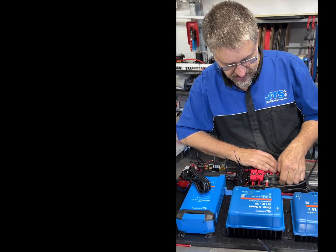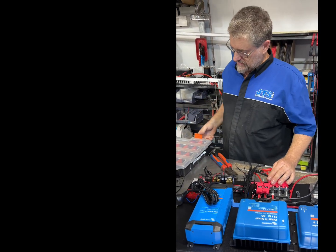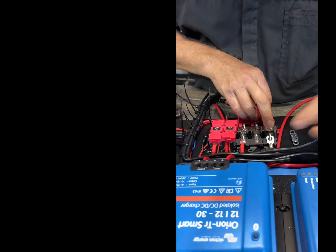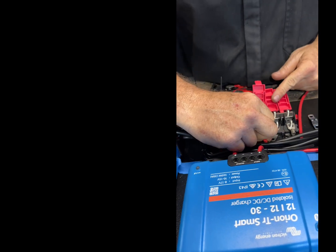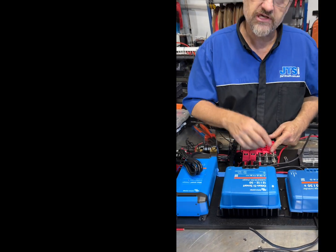Because of those two steps, what you can do is actually put a lug — an 8mm lug — on first before the fuse, and you can lock it over that. When it locks over like this one here, it does not move, it does not wiggle, even without a bolt on it.